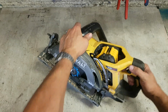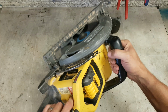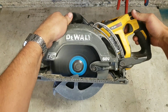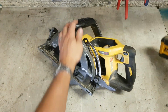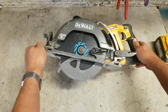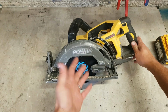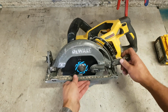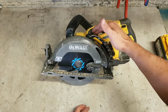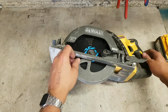Oh, nasty. So that's a bearing. Not so bad. She's obviously done quite a bit of work. No shame in a bearing failing on it. Back of the top of the armature, big bearing, normally collapses. It's a bearing, they're going to fail eventually. It's not too bad when they've done this amount of work. As long as the motor's starting on it, you're good to go. Change the bearing, should fix the problem. So we'll get into this one and fix her up.